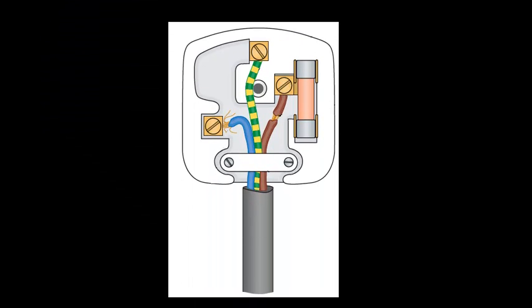Some common faults with wiring a plug — see if you can spot some faults here. Well, here is one: we have an insulation break in the live wire, which could be dangerous if it touches or makes a short circuit with another connection. The earth wire should be routed around this raised part of the plug, because the cover of the plug screws into this hole and will press on the earth wire and could break it. So there is a fault.